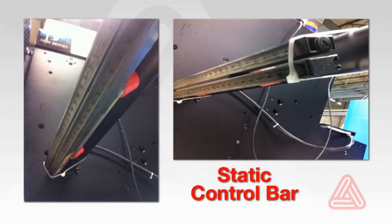To control static and its effects, first ensure that your press and all inline components like automatic unwind and rewind stations are properly grounded. Frequent shocks or sparks are an indicator of a problem. Second, consider installing static control bars before your first print station. If you're using web cleaning equipment, you may also want to place them before and after the web cleaning station so you don't redeposit debris after removing it. Third, make sure that the press room and especially the area around your press is clean — this is just good housekeeping but it really does make a difference.